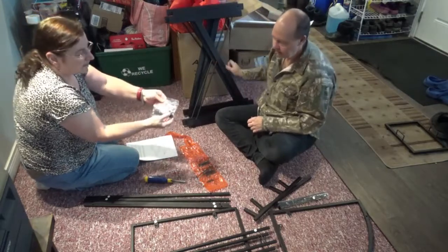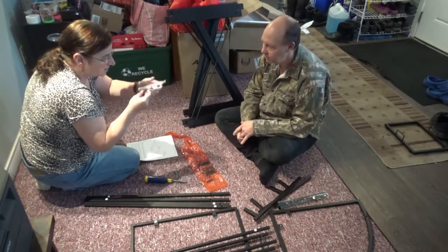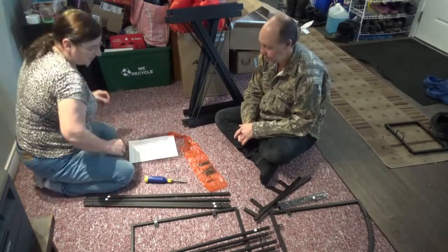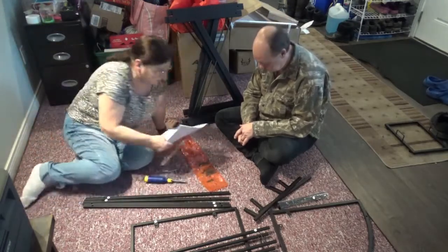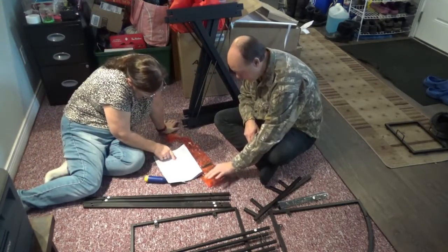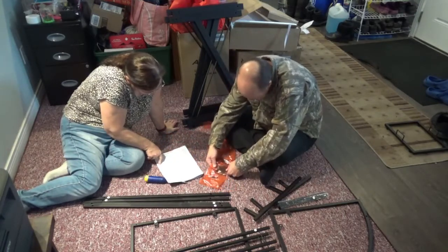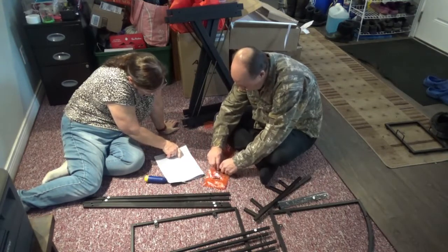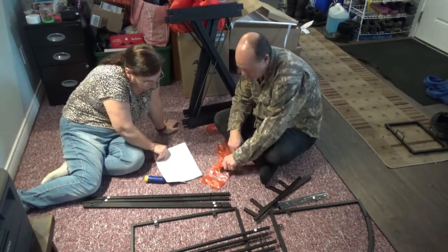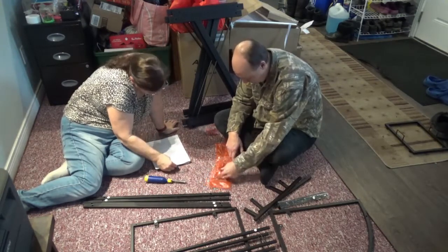Get a bag of spare parts. Suction cups, two feet, three suction cups, and three bolts. Hope you don't need any more than that. Okay. Step two. Attach upper crossbars to keyboard tray supports, 4L and 4R, using medium bolts. Note: the proper alignment of all bolt holes is shown above. Tighten medium bolt C with wrench A, which you get right here. Okay, these are all bolt C's.